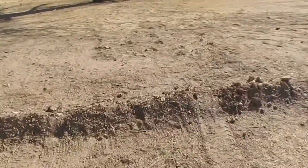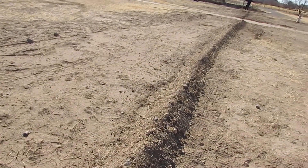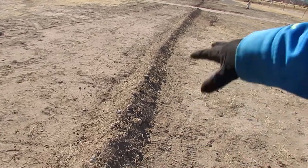Got our equipment here, the trenching is done already. As you can tell we have this slope — because if you just make it even, in the future it's going to go down. So whenever you do the trenching you've got to have a slope.